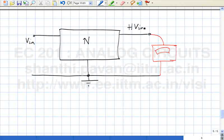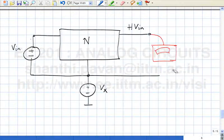We all understand that ground is simply a reference with respect to which we measure voltages. To make things explicit, I will make V_in this way. If I now lift this node off ground and make it some arbitrary value Vx, nothing will happen to the voltmeter. But if I connect the other lead of the voltmeter to this new ground, what will the reading be?